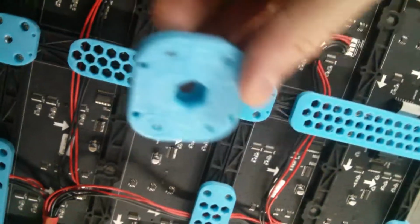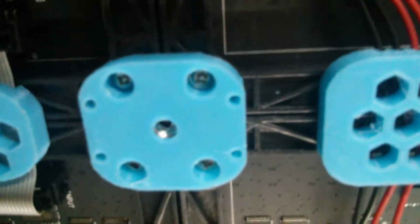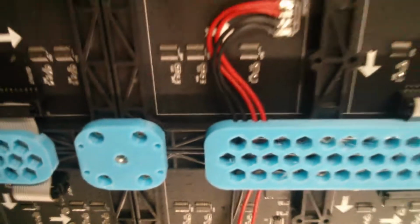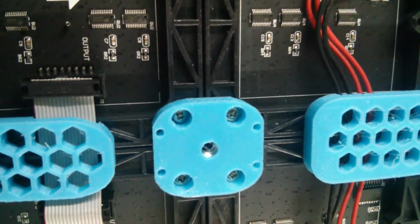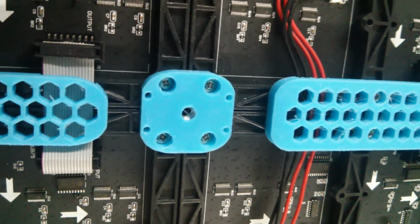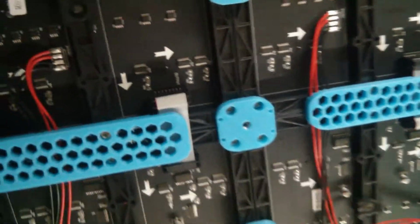So on the bottom side of that, you see that there's another one of those hexagonal insets, and that's for press fitting a nut. So you can see that I've done that on this particular piece. The screws are all countersunk so that I can get a lower profile. It's effortless to countersink screws like that, and it adds so much value, both aesthetically, but also because you save plastic and you keep your profiles low.